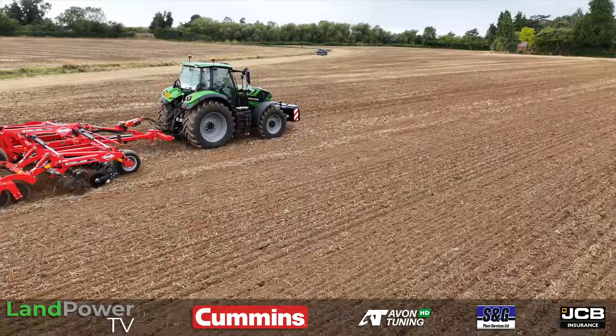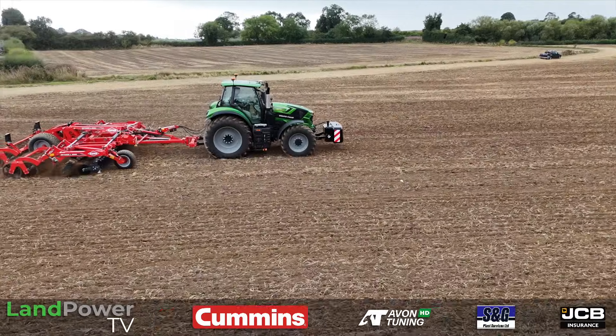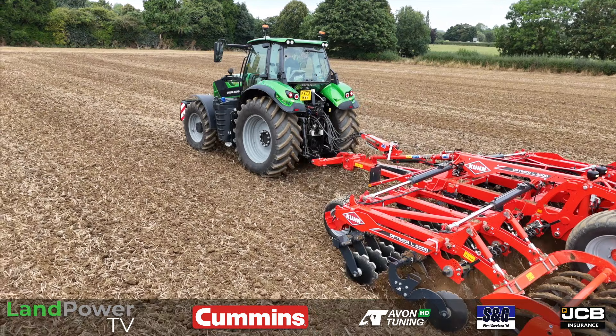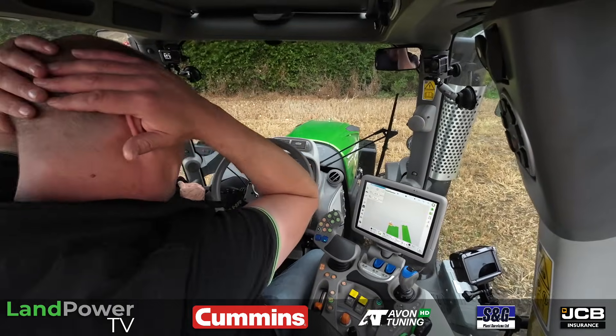And that's it, is it? Well, we've got the headland trigger that's going to lower the machine into the ground. I've not even dropped the machine - it's done that because you've set a virtual boundary. We've got boundaries to the field, we've got an inner headland boundary, and the new headland management system's got a GPS trigger which we've activated, and that's going to raise and lower your cruise speed and raise and lower your implement. We could add other functions in there as well. As we're approaching this headland, do I have to do anything? Nothing at all. Don't touch anything. There's a hedge in front of us. It'll move.